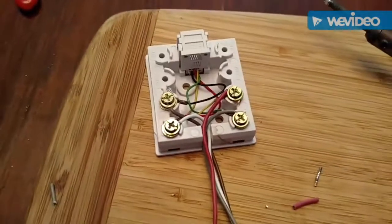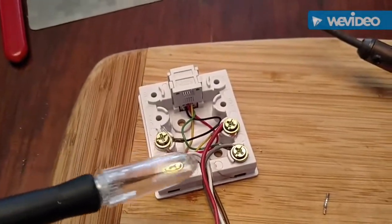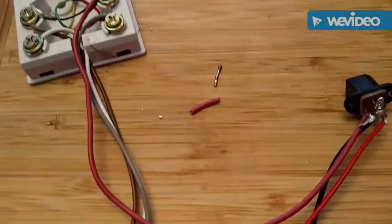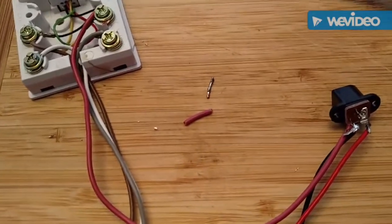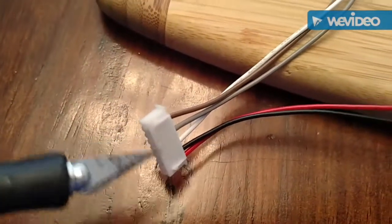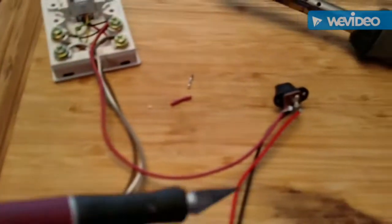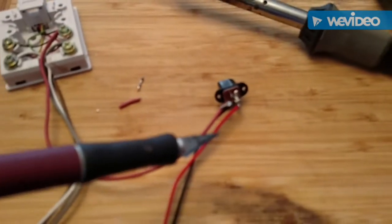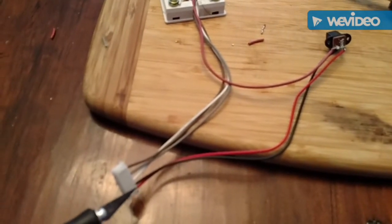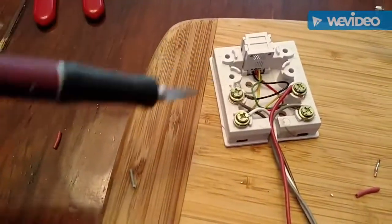Now what we've got is this wired up where you can see the brown lead, white, gray, and then this is my com — my ground. Come back over to the plug. It's a K size, which is what came with the transformer. You can see I've got two wires. The black lead is from the Monoprice curtain controller device. I just happen to have red wire — if you can only use black for ground, then buy black wire. You've got your positive, your ground, your negative. You've got your white open, gray close, and brown stop, and it translates over here thusly.